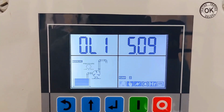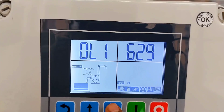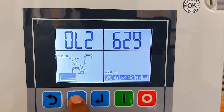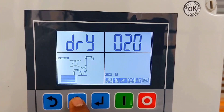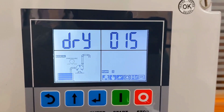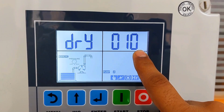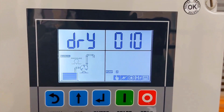For example, if your pump running current is 5 amperes, you can set 6 to 6.5 as your over current. Then you can set the overload for pump two as well using the up/down keys. Next is dry run current, set in percentage — 15%, 20%, or 25%. This percentage is based on the overload value you set. So if pump one overload is set to 6.5 A and dry run is set to 10%, then 0.65 A will be your dry run current threshold.